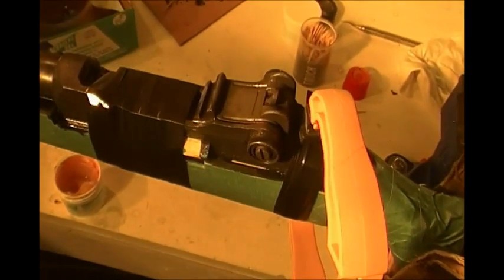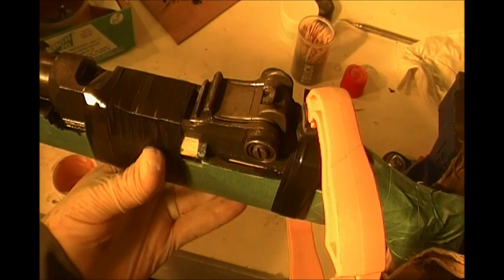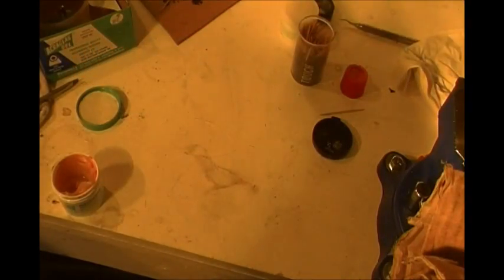We've got a little bit of upward tension here. We've got it taped up and a clamp on it — probably didn't need the clamp, but I just wanted to make sure we had a good solid go into the bedding area. We'll take her out of the vise and flip it over to check from underneath, make sure we don't have a whole bunch of excessive product coming out. If we do, we'll clean that up while it's still soft. There's some along the edge and some along the front, but it will clean up fairly nicely because we used a liberal amount of mold release agent.